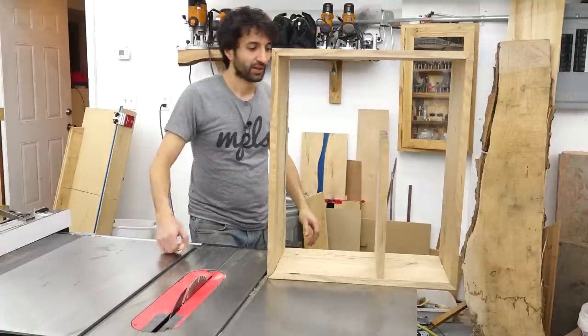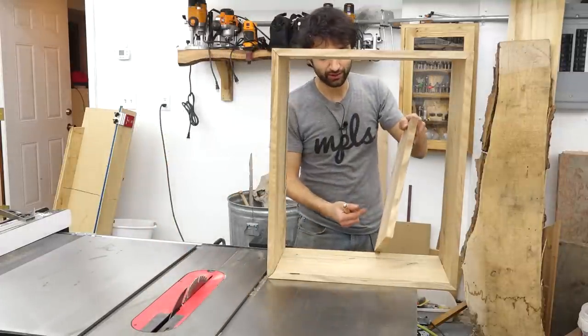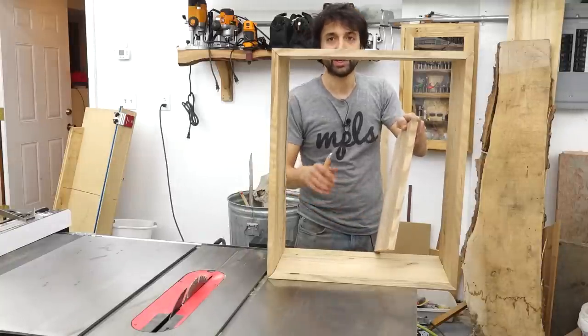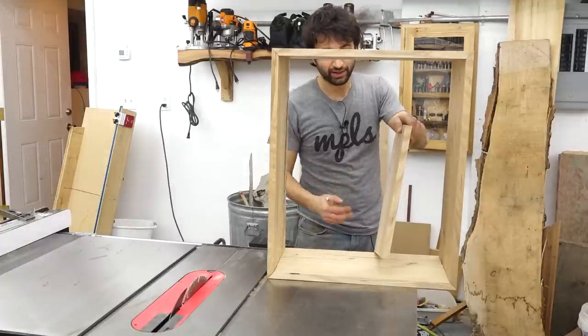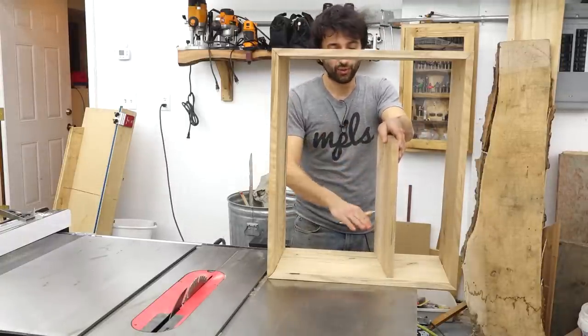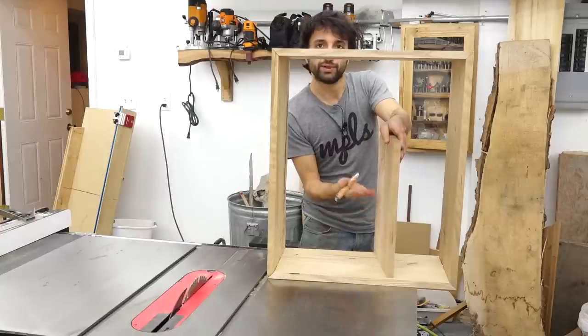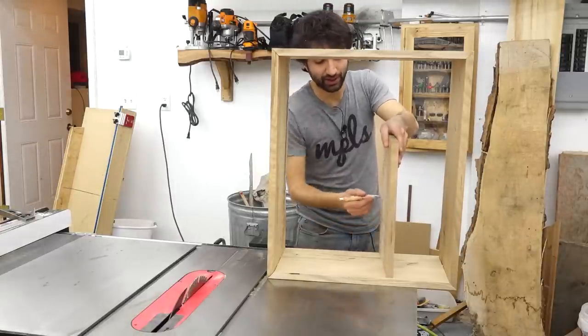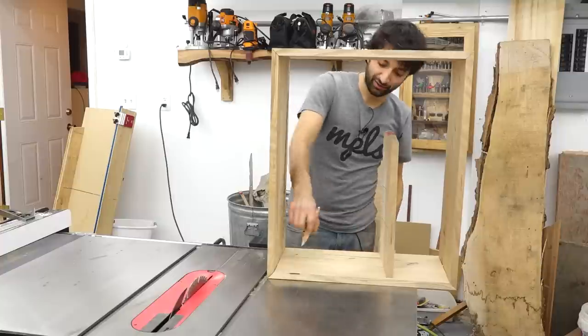So I have my divider stock here for this vertical divider, which has the same exact saw patterns as the case side. And I have the top left long so I can trim it to final length once I know where those dados are going to stop. So I'm going to make some lines on here so I know that's the side I'm supposed to cut dados on.